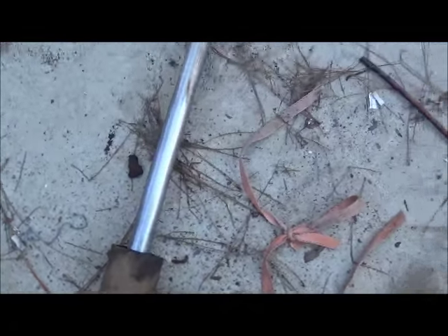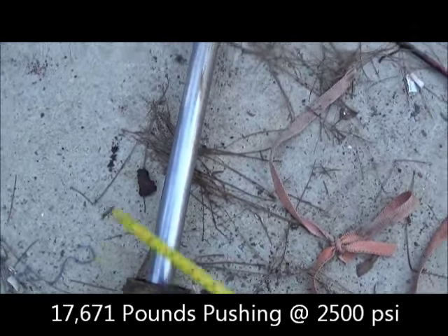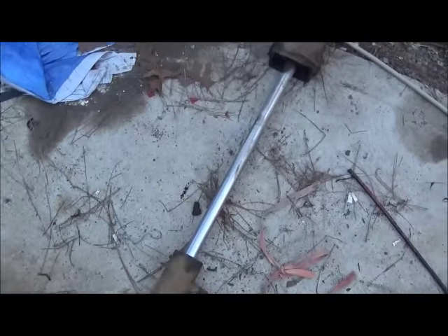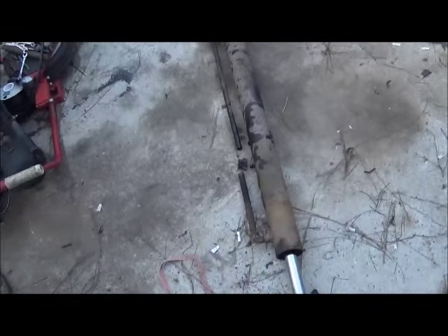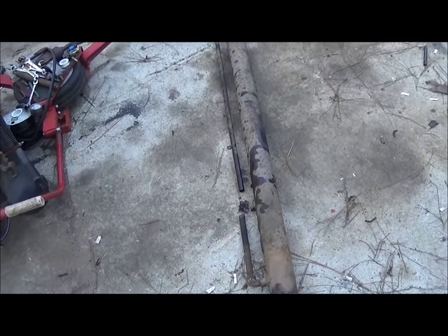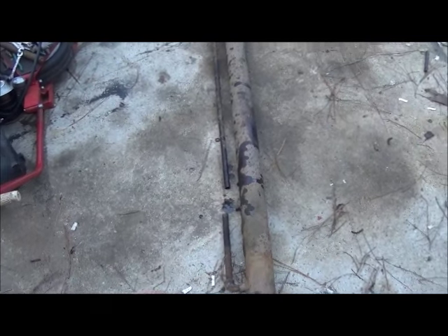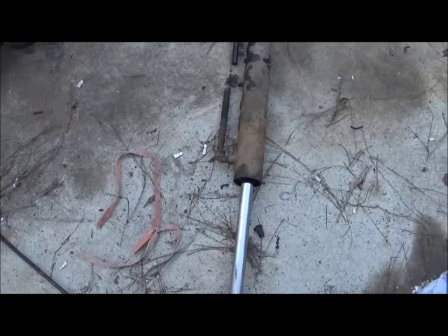With it being on rollers, we shouldn't have any trouble power-wise. I think this is a 3-inch bore inside, and I can figure with the pressure and weight what that's going to push — it's going to be more than what we need. I think with the rollers and the way we're doing this, we don't need two cylinders pushing. The only way to make two cylinders push evenly is to use a flow divider that equalizes the flow. If you just tee two cylinder lines together, the flow takes the path of least resistance and pushes the easier cylinder — you can still cock it sideways using two. So it's really not going to help us doing that. This is the cylinder we plan to use.